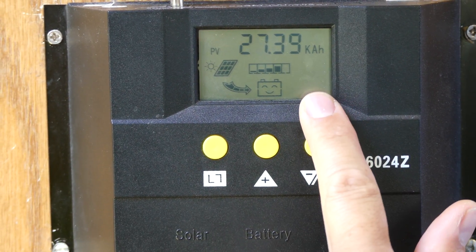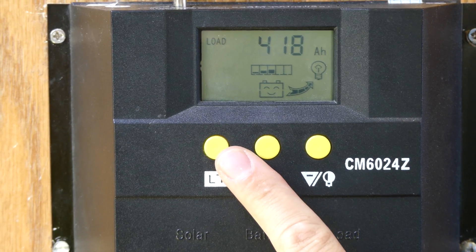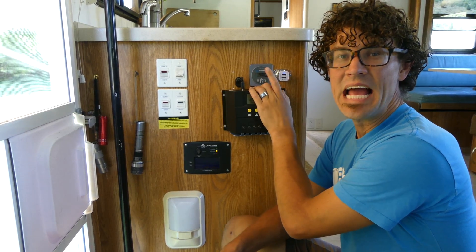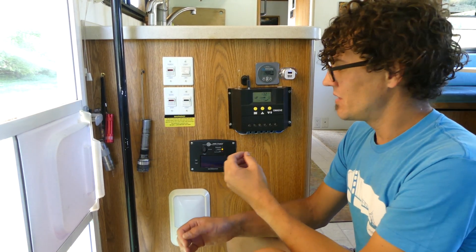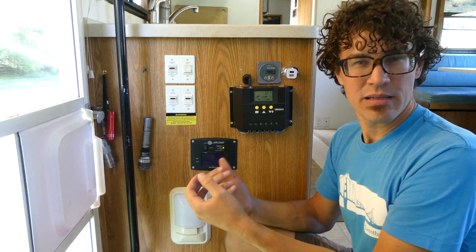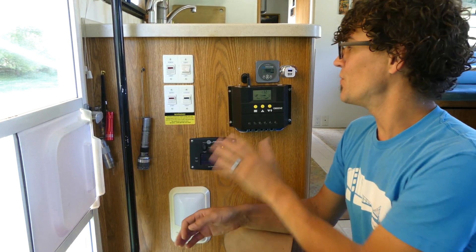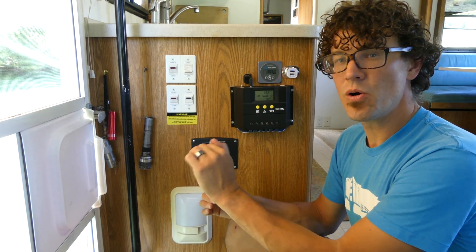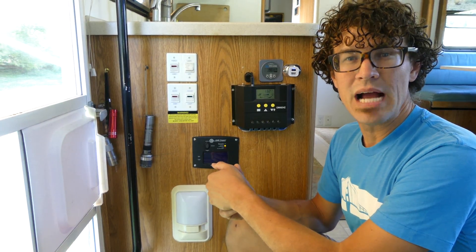That's the total all-time energy we've generated — 27 kilowatt hours. When we first started out, we did not have a battery monitor. And now that we have it, we don't feel like we could live without it again. Without a battery monitor you're trying to kind of guess where your battery level is at by looking at the voltage, but that's not at all accurate — it's just a complete guess. Knowing the actual percentage that you have left is so critical because if you get too low with these lead-acid batteries, if you get under 50%, it really damages the battery. So it's nice to know exactly where we're at so that doesn't happen.